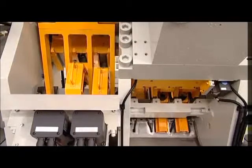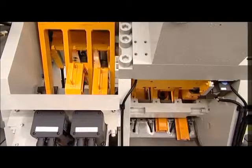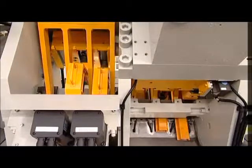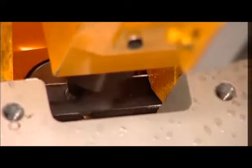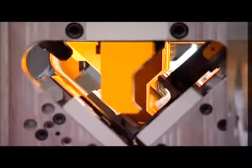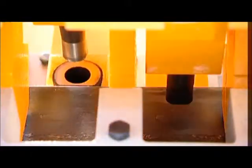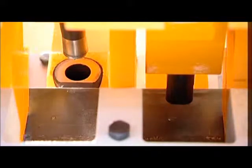The A164166 is equipped with two punching units, one for each leg. Each unit can contain up to three punches. Each punch is CNC controlled and can move horizontally in relation to the sections, so that holes can be punched in any gauge line under the system software control.